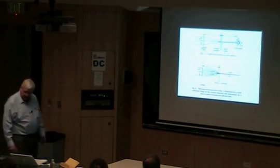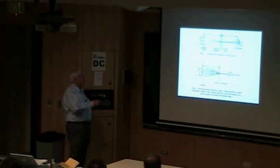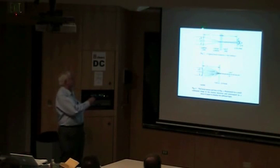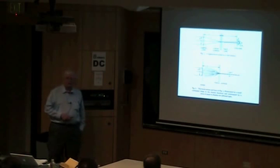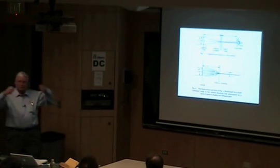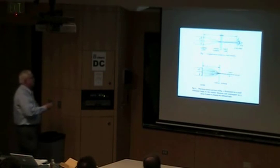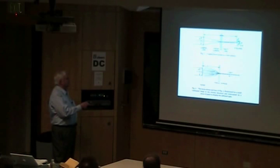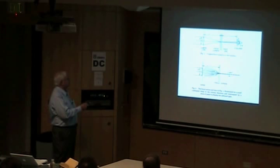Now, I mentioned the 2 degrees. Let me show you what's happening here. Here's an old-fashioned view camera. You've probably seen these. There's the camera lens, there's the focus screen, there's usually some kind of a Fresnel field lens. Then there's an eye lens in your eye, and you only need the eye lens if you're coming in close. If you're the old timer with the big glass plates and the black cloth, you don't need the eye lens because you can see it okay. All right? But what you're really doing is taking this rather small bundle of light that's going to your eye, and you're trying to get samples of light from all parts of the camera lens.